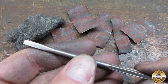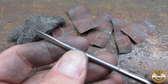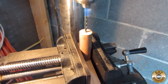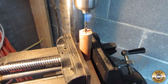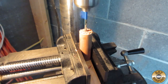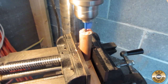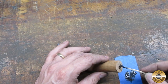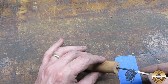I sanded the shaft and tip by hand down to 600 grit and polished with some super-fine steel wool. I've had this piece of one-inch cherry dowel for years — I forget what I originally bought it for, but it seemed like a good candidate for my screwdriver handle. After drilling the hole I epoxied the shaft with JB Weld. Between the splines on the shaft and the glue I felt like I had a secure fit.